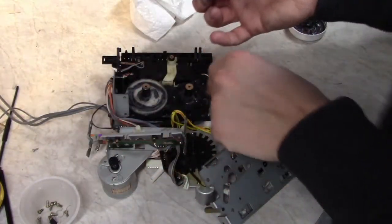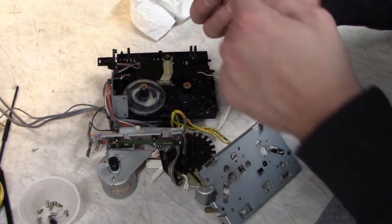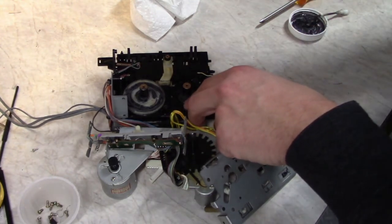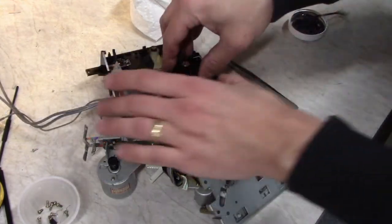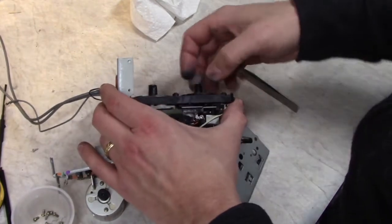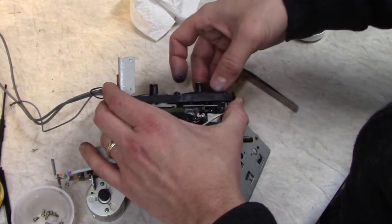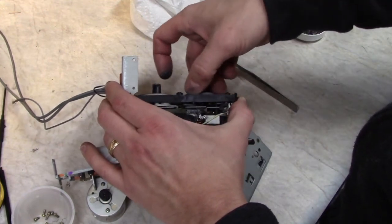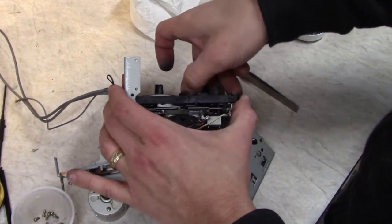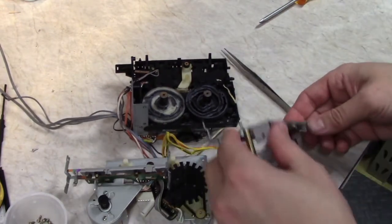And again, the pinch roller one goes on this inner groove here, and the playhead arm goes on this outer groove here. Alright, take it for a spin here. Definitely want to make sure you got this right, because if you mess it up, you have to take it all apart again. One direction. So the playhead's going up. Clean your hands. That molly lube is tenacious stuff.